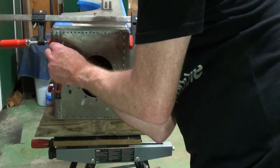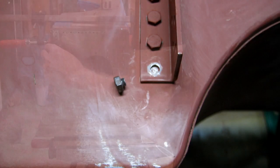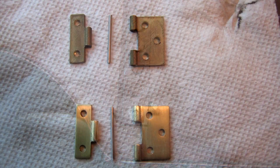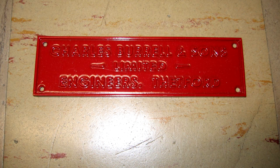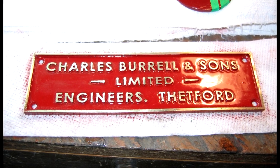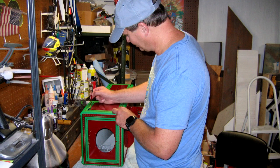There were two dummy bolts forgotten prior to priming the assembly. Paint was cleared off and two bolts trimmed down to fit, then attached to fill the respective bracket holes using high-strength retainer. All brass parts were cleaned and polished. Painting began, including paint over the polished brass builder's plate. After allowing ample time for the paint to cure, lining began by taping off the various lines with appropriate thicknesses of tape. Sections of tape were removed to uncover the proper width lines for painting, with some areas requiring touch-up or freehand lining after the tape was removed.